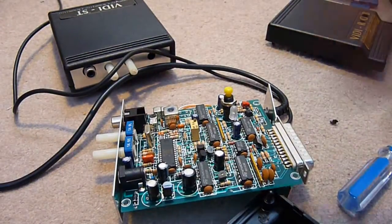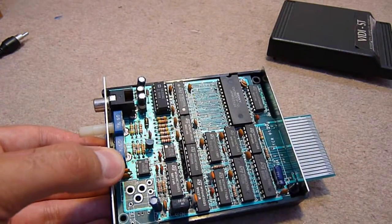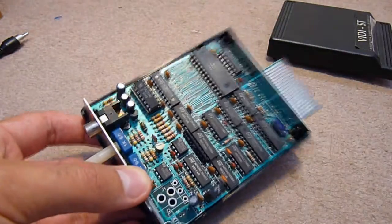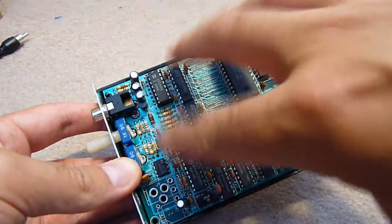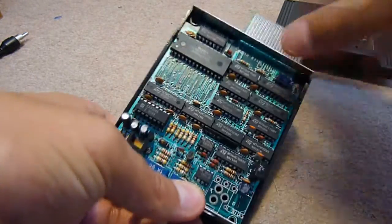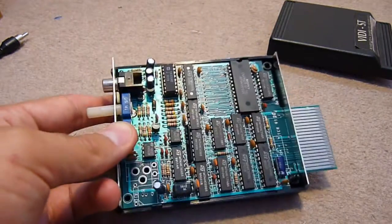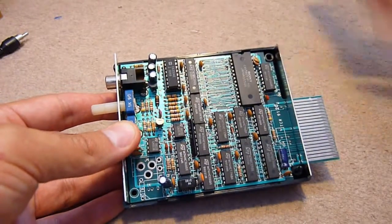Let's go on to the other unit — the digital side. We have what looks to be a ROM, could also be a RAM chip, although more likely to be some sort of mask ROM as it is a cartridge. And of course the necessary discrete logic — it will have analogue to digital converters at the front end around this area somewhere, as well as a whole load of 74-series jelly bean logic. When it comes to these things, the magic's done in the software, not in the hardware. Still, rather quite interesting specimens if you ask me, because I like my obscure, weird hardware and this certainly fits the bill.